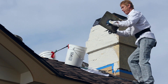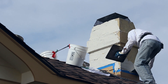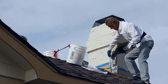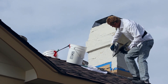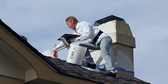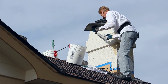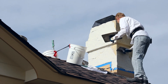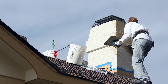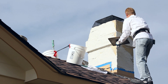I'm switching from my favorite Conga trowel to this little square trowel, which is what the majority of folks use. I generally use my 20-inch trowel to get it done faster. I'm putting it on a little fat because I have to float this — floating and sand finish are the same thing. Never stand on paper: we have paper on the roof so we don't get stucco all over it, but paper slides, and so do you.